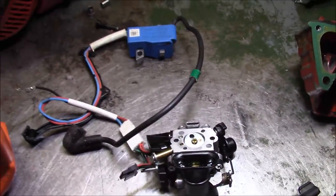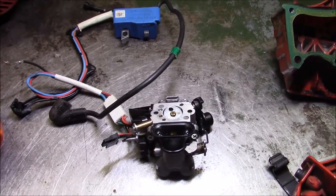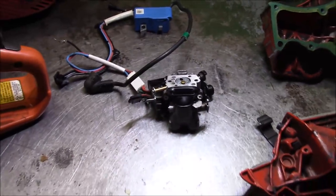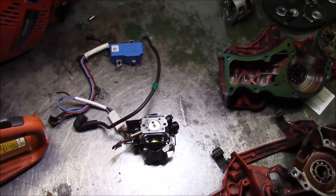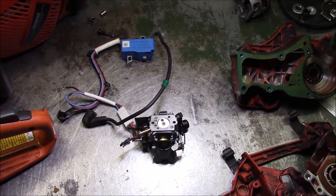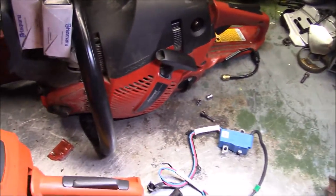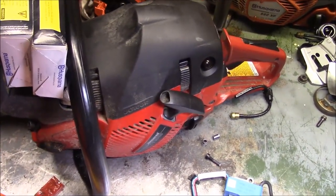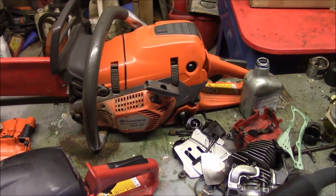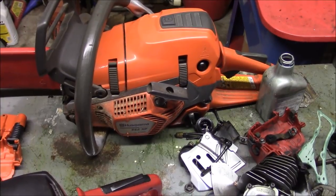It leaves a bit of a history on the chip. When you go into Common Service Tool and plug in, you can read that history and get a sense of what's happened to that saw. That's an overview — but if you understand that much about Common Service Tool and auto-tune, you'll realize there's an awful lot you can derive from that information. Without further ado, let me break out the computer, confirm this guy is okay, do a firmware update if needed, get a clue on what's going on with this one, and see whether that saw has information in its carburetor that CST can download and recognize as a problem.